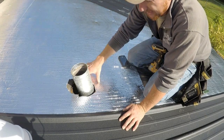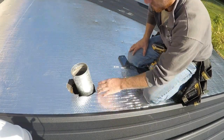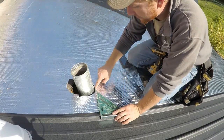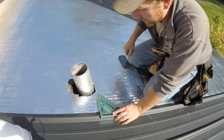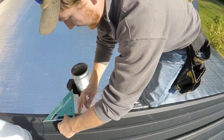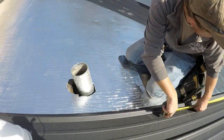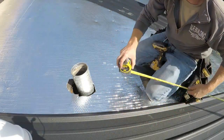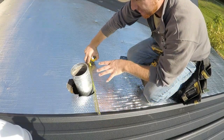Remove the old boot they had for the shingle roof. Then when you come across the roof with your metal and you're ready to cut out your hole, one of the easiest ways is to use a square and stay back about an inch or half inch — you don't want the metal tight on your boot. Use your speed square to square across and draw lines on the last rib of the sheet you've laid down, then run your tape measure down the roof to get your measurements. Measure up to each line to get the distance, then measure from the center of the last rib up to the boot — that's how you measure the location of your boot.